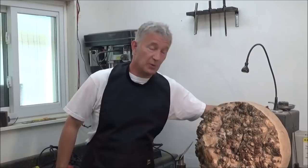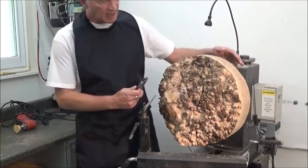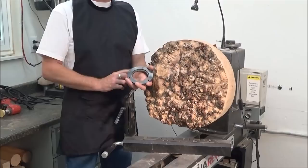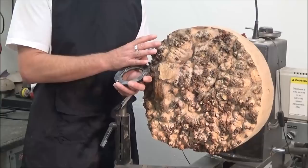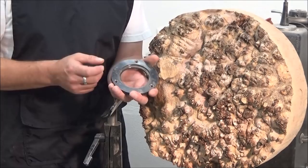This piece — I've got a really nice piece of maple burl. I've got it mounted on a faceplate ring. It's about 18 inches diameter and approximately 5 inches thick. I like them — there's a dovetail on them, and if I don't get around to finishing the piece or I want to take it off and do something else, it's easy to remount. You'll get it back in exactly the same place. Those are very useful if you mount a piece and don't necessarily get around to finish turning it.